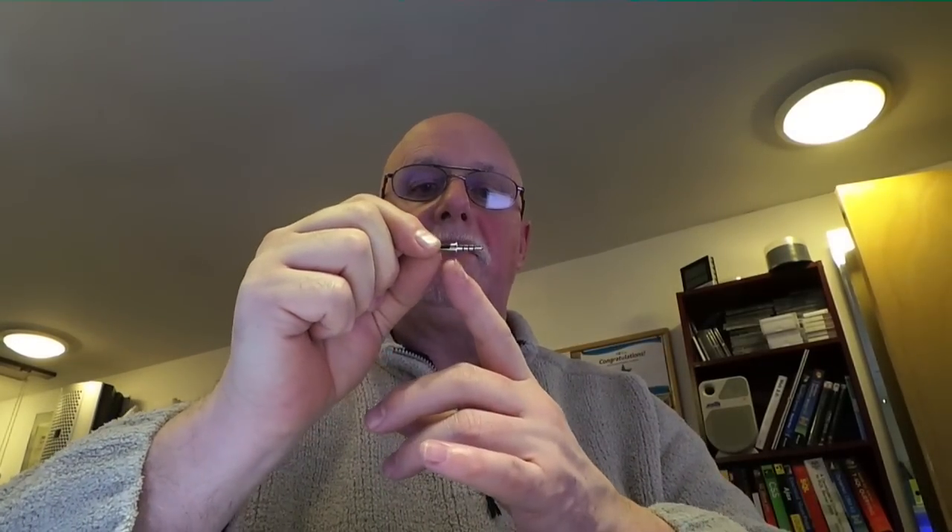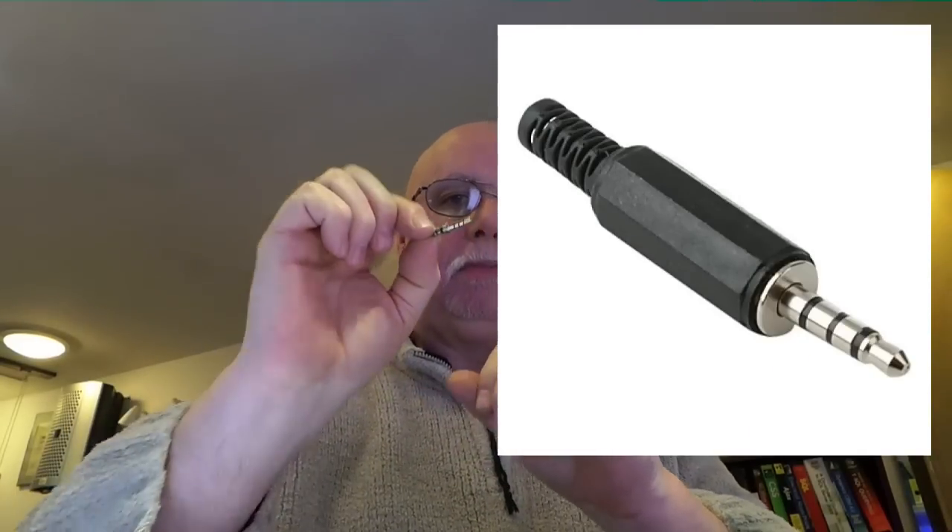The connectors — you'll see one here, I'll just take this out of the pack for you. There's a typical TRRS connection that's got four connections: the tip and then two connections and the outer shell. If you're into electronics at all, you would expect the outer shell to be the ground and then the microphone and then the two stereo outputs for headphones. Well, that's wrong. In this case, they don't use the outer shell as the ground — they use that third pin as the ground. So your standard connector is not going to work.